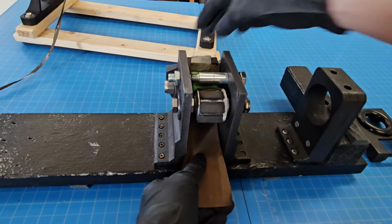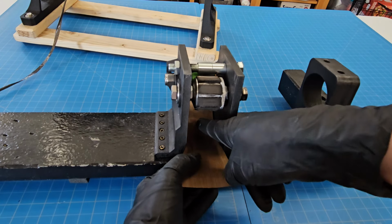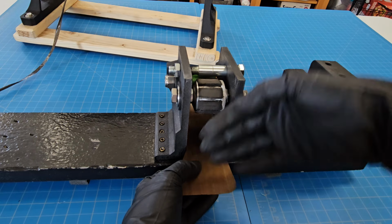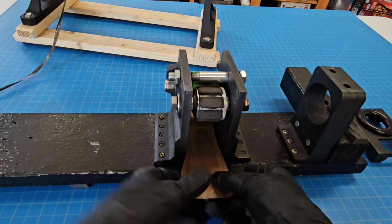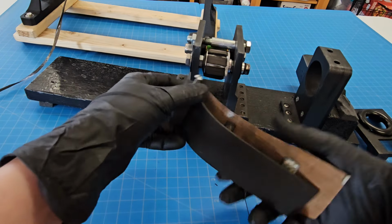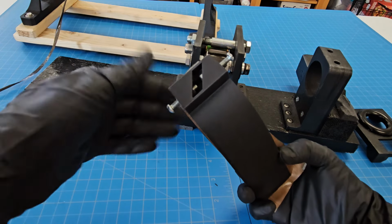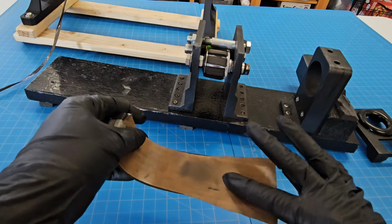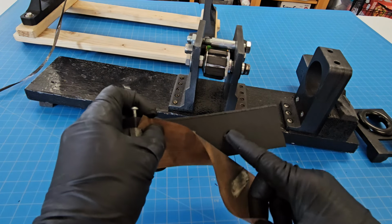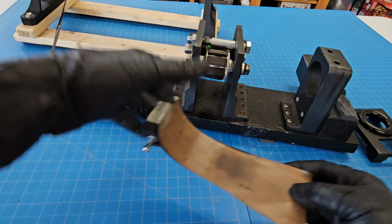This here is the chute for the carbon fiber to come out. It needed to be smooth so that it wouldn't get caught in the chute. It needs to go out. It didn't do that perfectly, but it was okay. So this is actually a separate piece. It's 3D printed, and it has these screws on it, so that has something to rest on at the back. And then a little piece of the Teflon coated peel ply was taped over the top. Because this is kind of textured, the carbon would definitely get snagged on that, but it slid over this pretty nicely.